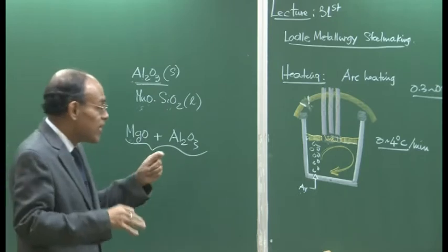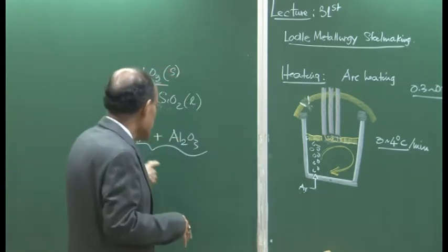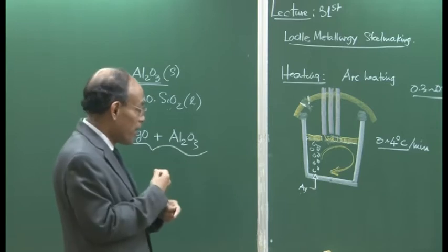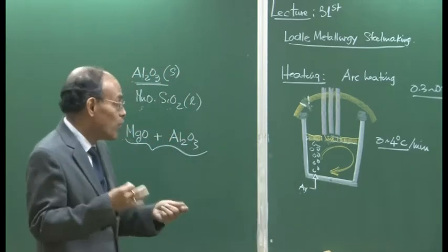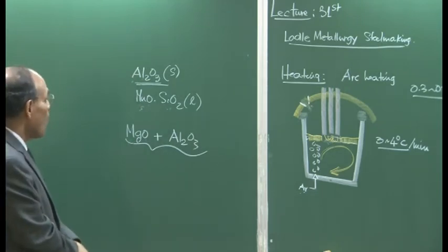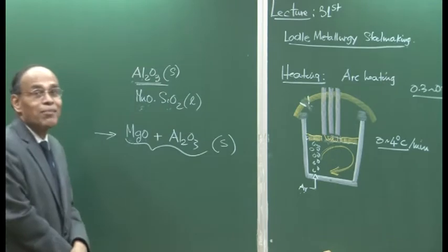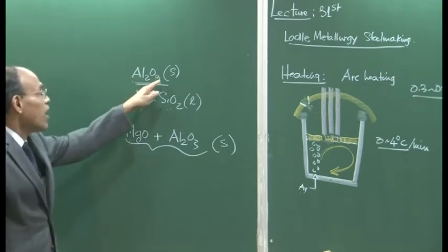And we must understand that at this particular stage we are talking about concentrations of various species in the range of only a few ppm. So, nothing is negligible. We want to have as pure a material or additions as possible, but we also know that as purity increases, the cost of production will also tend to go up. So, the spinels, these are called spinel or double oxides, are also solid under steelmaking conditions. These are solids, they are non-deformable.